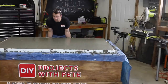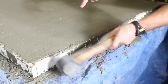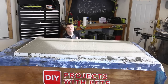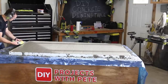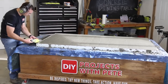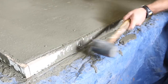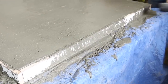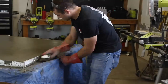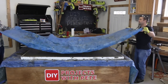Slightly lifting the table up and down quickly works really well, but it is heavy so try to find someone to help you and make sure to lift properly. A rubber mallet also works to vibrate the concrete — you can tap the side walls and underside of the mold. The vibration from an orbital sander or a reciprocating saw without the blade are other options to help release the trapped air. The more time you spend vibrating the concrete, the fewer air pockets and voids you'll have to fill with a cement slurry paste. Use a trowel to smooth out the bottom a bit so the underside has somewhat of a smooth finish. Then clean up the work surface, sweep up that excess concrete, and put plastic or an old tarp over the concrete to help it cure more evenly.